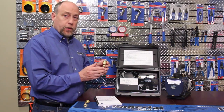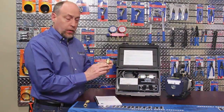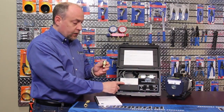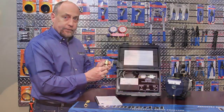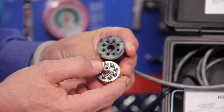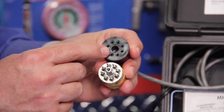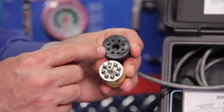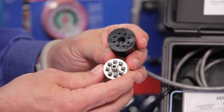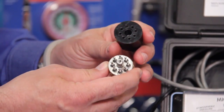All of the thermistor vacuum gauges come with a 4510 vacuum sensor. On the sensor is stamped the calibration point — this one is 31.25 — and that calibration point is what we're going to set on the calibration scale when we configure the instrument. One of the most important things to remember about the 4510 sensor is that the sensor is keyed. There's a small key here and a key slot in the plug. If you don't position the key properly, the meter will give you an erroneous reading that will either take it all the way towards zero or it won't read at all.